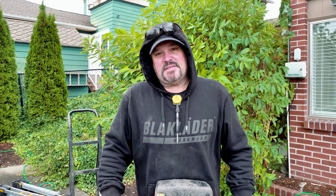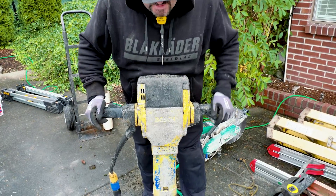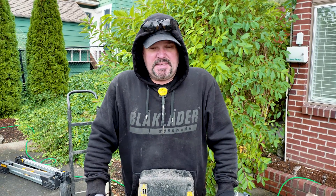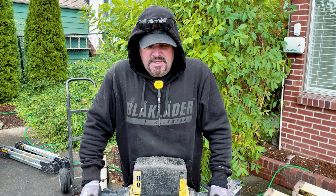There are usually electric jackhammers — there are 40 to 45-pound jackhammers, and there are 60-pound jackhammers, which is what this is. The reason they call it a 60-pound jackhammer is because it weighs about 60 pounds — I think this one is 64 pounds. This is an old Bosch jackhammer I picked up really cheap. It needed brushes and wasn't running when I bought it. I replaced the brushes for 35 bucks and now I have a decent 60-pound jackhammer.